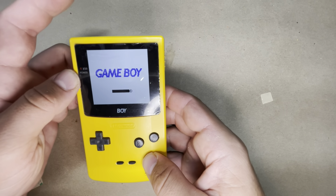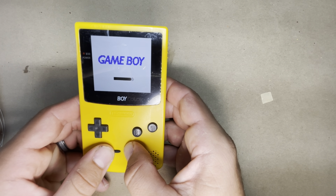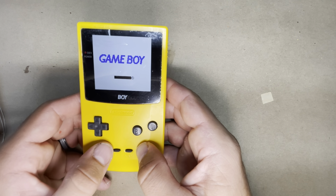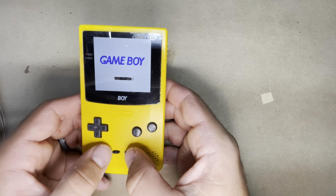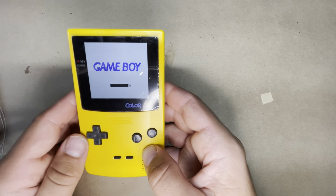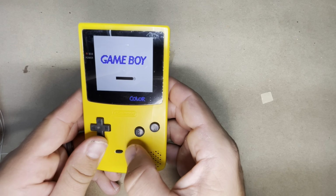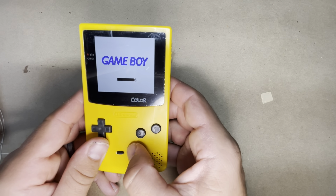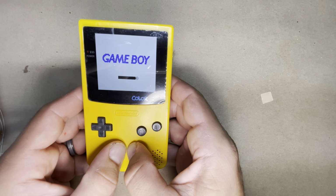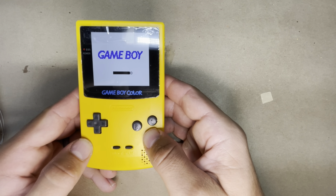And then you're gonna tap the sensor one more time. This will go to the X position, and if you press start, this will move the screen to the right, and select will move it over to the left. So once you're where you want it, press select and start once again, and then you can tap on the sensor and we'll go over to color, and this will change the color of the background. So once you choose the color you want, press start and select again, and this will exit out of it. So that's it, you're all done.